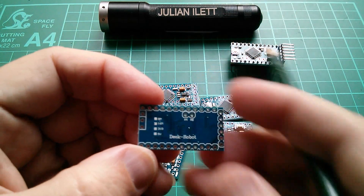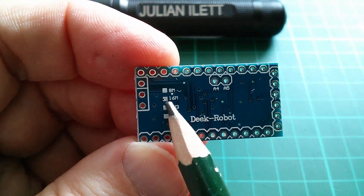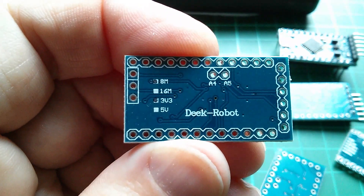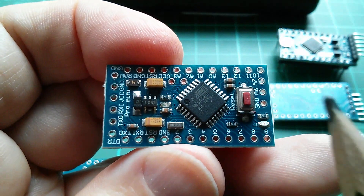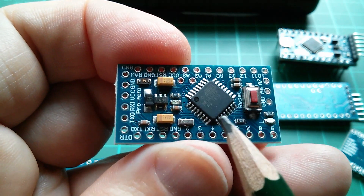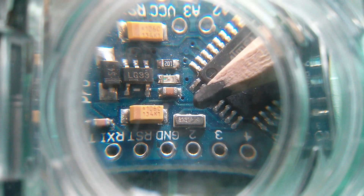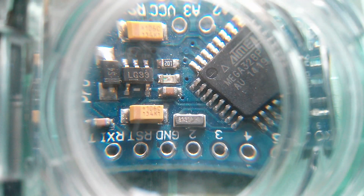Sometimes on the back there are a series of silkscreen squares, but they're often not marked. This one here is marked — 8 MHz ceramic resonator, 3.3V regulator. I may possibly have marked that myself when I got it, which was sensible. So how can we identify it from the components on the board? The two components of interest are the regulator, which says LG33 — fair guess that's 3.3V — and the ceramic resonator. Even with a double macro magnifying lens it's quite difficult to see, but I think that says 80S, and the 8 is a little clue to it being 8 MHz.